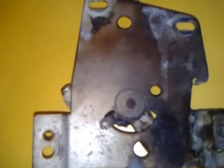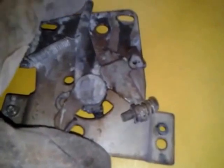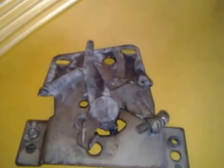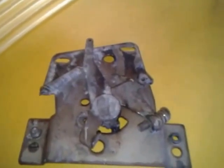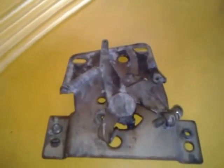Now let's take a look at the regular front throttle section, which I took off as I promised. This is the regular component on this tractor — it's kind of like an automatic choke control. You have your single lever throttle, and then in the back here you have a system of springs which, when the throttle gets to a certain point, will pull the choke back and turn the choke on or off just for starting. But it wasn't working particularly well on this tractor — I believe there are still some issues with the carburetor I have to clean up. So I just took it off to get the tractor running for winter, and I'll be working on repairing that in future videos. But this is how your regular setup looks like for your throttle.